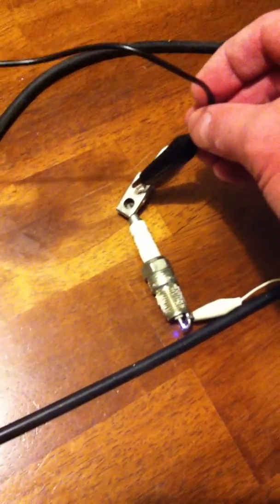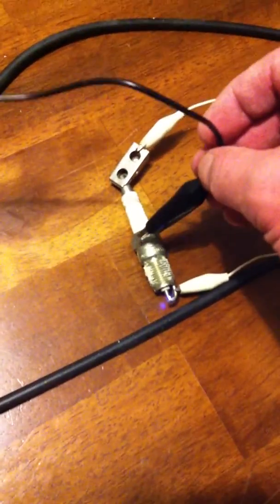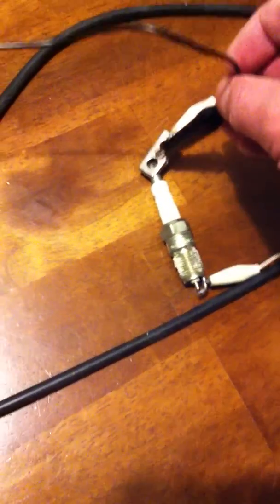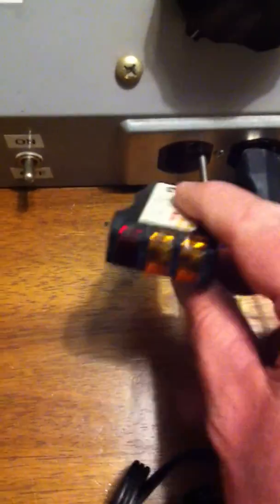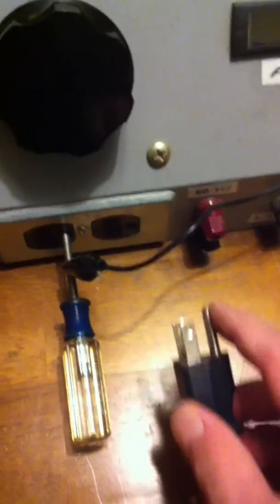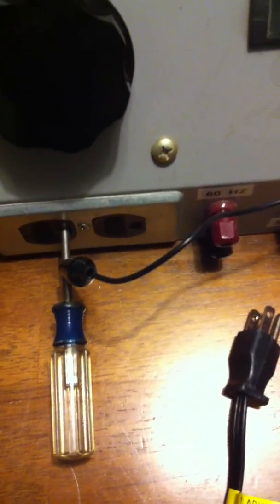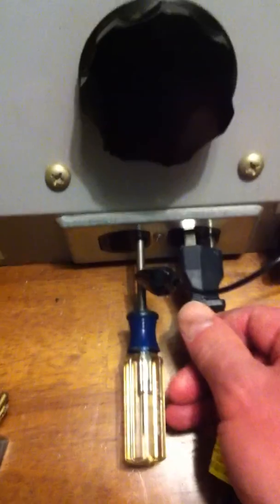This should only be used for work of this type because it obviously disables the safety circuit designed into this power supply, but it does make it possible to do the work. Here I'm just using a screwdriver as a ground into this Variac, and I have verified that the circuit's grounds are correct. What this does is it prevents the need for removing the ground plug — you don't have to do that. In fact, when I tried to do it that way, it didn't work; it required the modification I just did.